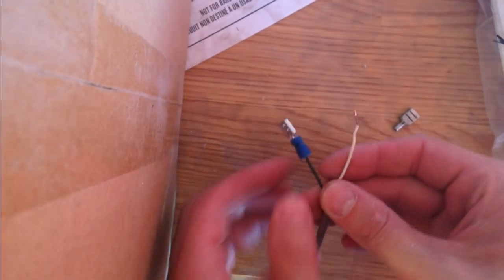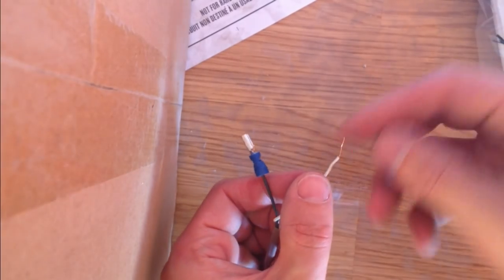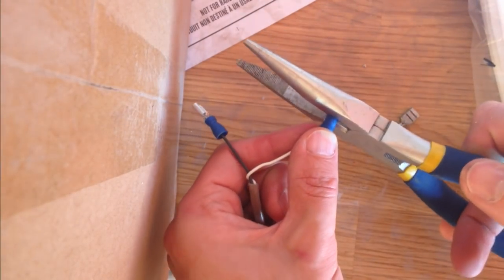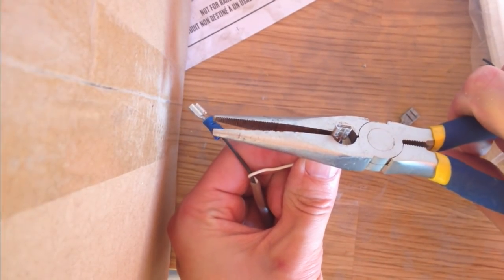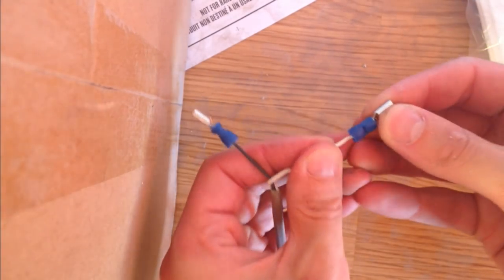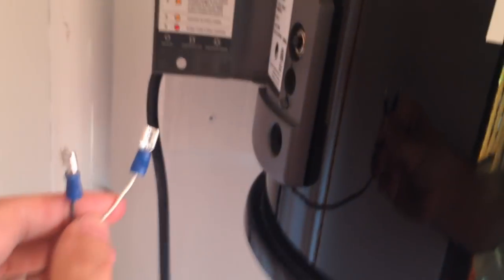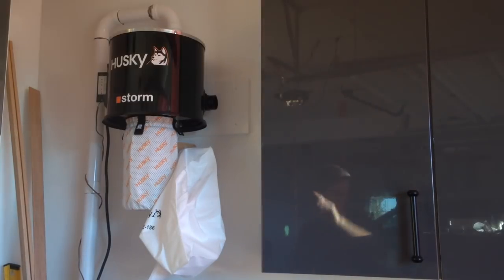My next step is to attach these blue end pieces. I've got my wire and it's already stripped. In order to crimp the end, just using a pair of pliers — the piece that's used to cut the wires — I just crimp it good and tight, put a dent in it, and then the wire won't come out. Next I'm going to plug these wires into the central vac. I've wrapped it around the pipe just so that it's a good length, and then it doesn't matter which one it goes into — let's put it into place there and it will just slide in. It's a bit tough to get in there, it's a bit stiff, but there we go. It's in place.